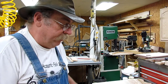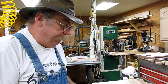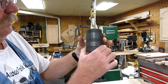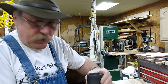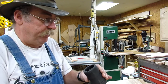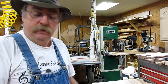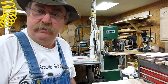I didn't get video of taking this thing apart — I thought a little bit further ahead, I guess, it might be of interest to somebody to see one of these things torn down and the bearing replaced. But anyway, I've got it torn down here. I'll clean it up and show you how it goes back together — all these pieces back into a complete spindle assembly for the shaper. This is the actual housing the spindle gets assembled in, and the bearings go in it, then it drops into the lifting mechanism with the belt on it.